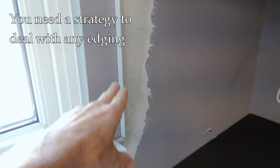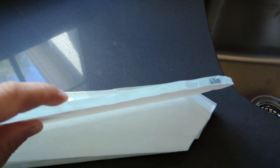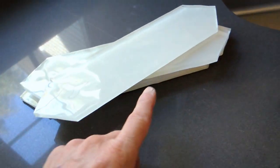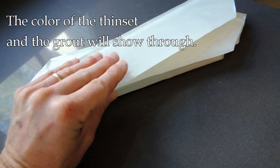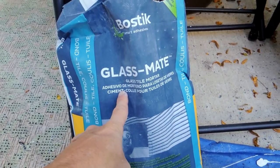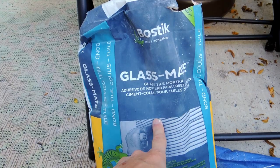You can't always do that, but in that corner over there, when I get to it, I'll leave an expansion gap so the whole wall can move back and forth if need be. You can see I have a metal edging here, because there is no bullnose or anything available for this tile. When I do get to the point of grouting, you've got to be careful about air bubbles as well. The color will show through because it is glass — it's translucent. On the sides there's no backing, so that will show through. Even the thinset itself is a special type meant to allow for expansion and contraction.